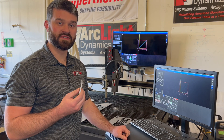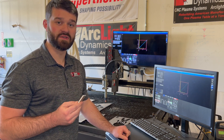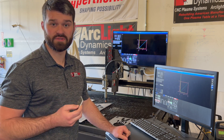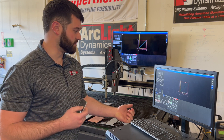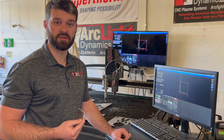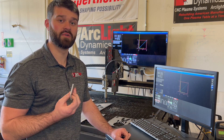To figure out this 3/16 aluminum, we started with a known tool — a quarter-inch aluminum tool. We used the feed rate for that with torch height control off to see what kind of cut quality we were getting. We found that our cut quality was pretty good based on the quarter-inch speed: minimal dross, good angularity. If we wanted to adjust that, we could have gone into the manual tab and adjusted the feed override. And then paying attention to what the voltage is without torch height control, we can go in, adjust our cut speed and voltage in SheetCam to get the final cut quality we were looking for.